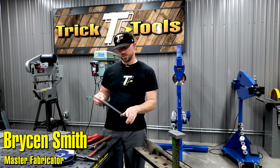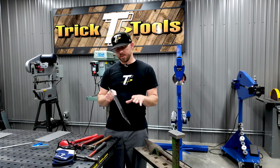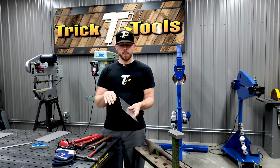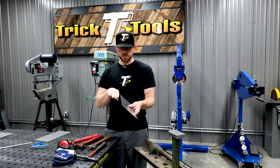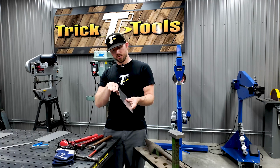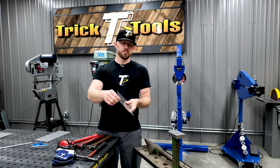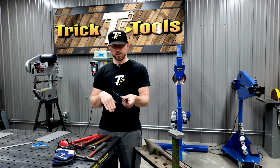And for today's tip, I'm going to show you guys how to hammer a flange over on the edge of a piece of sheet metal with as minimal distortion as possible. So anytime you're bending a flange over, typically you're stretching the edge that you're bending, just as a result of the action of starting usually at one end and working towards another, whether it's in a bead roller or maybe even a power hammer or something like that. You're typically still starting at that one edge, and as you start tipping one edge this way, there's a little bit of stretch that's going on in your flange in order to get it all to move slowly down where you need it.